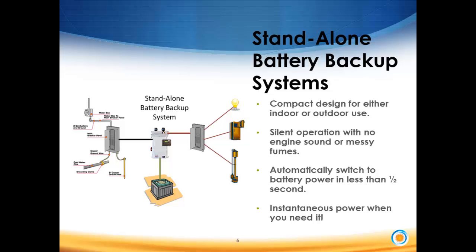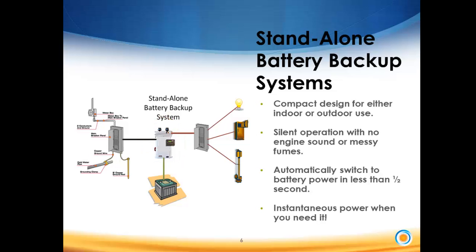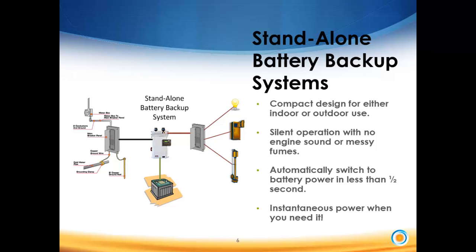We then connect the critical emergency load service panel to the primary service panel through an emergency inverter system. Your new mini grid is indicated by red wires in this drawing. Now, when the utility company stops sending power, the emergency inverter notices the lack of utility supply power and starts supplying power to the critical load grid within half a second of power loss. The emergency load inverter will continue to supply power until the batteries run out.